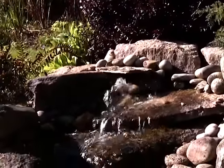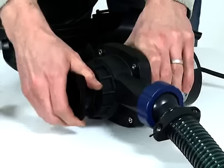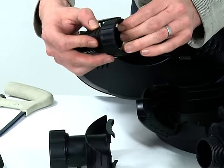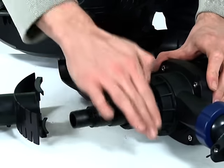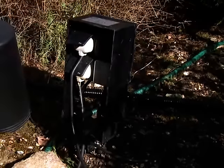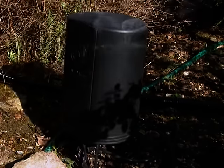If the pump is to be dry installed, remove the pump from the strainer casing and remove the second inlet connections. Cut down the shorter stepped hose tail to the desired size and push through the retaining nut. Insert the white flat gasket into the retaining nut, then screw onto the inlet thread. Connect to the inlet pipework and ensure the pump is mounted horizontally below the water surface level. Connect the power supply and check for operation.